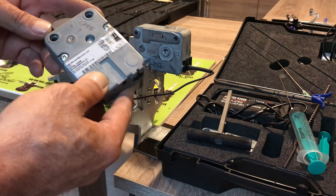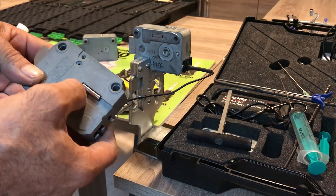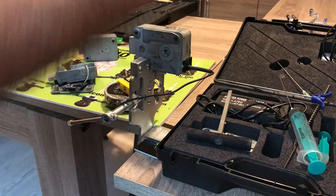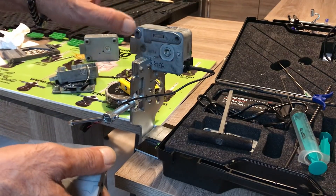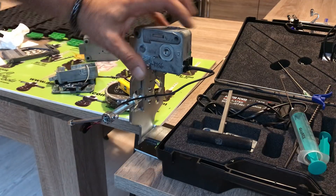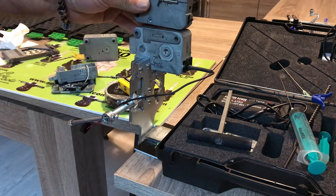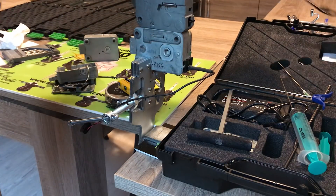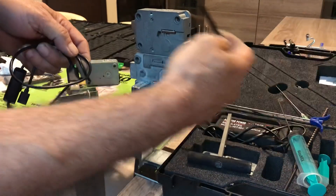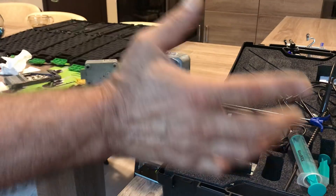The same situation is possible to apply also on swing bolts. You have to stay away from the hard metal piece — you break a lot of drill bits there. The difference on the swing bolt is that they can put the lock anywhere in the door of the safe. The dead bolt must be connected with a spindle and a keypad, for that reason it is very easy to go here and drill it. Even if the lock has glass or hard metal, you still have access to the lock directly. When you have to work with the swing bolt, we supply with this kit a camera to put on your cell phone, to drill somewhere on the side probably and to see where is the lock. You can drill from the side, from the top, or from below if you have options for that.